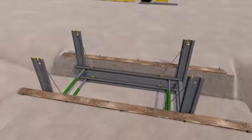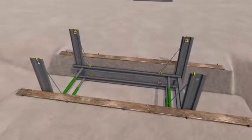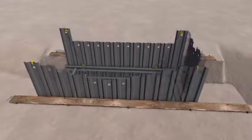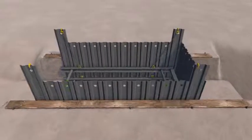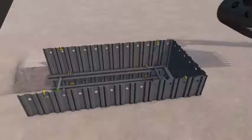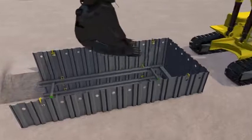Hanging chains are attached to the underside of the upper waler and the top of the lower. If available, an excavator-mounted vibrating hammer can be used to drive the sheets to finish depth. If it is necessary to support the ends of the excavation, sheets are installed to lie against the end bearers.